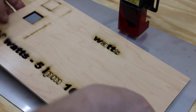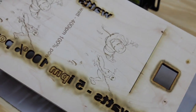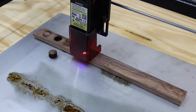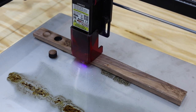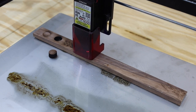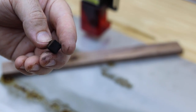The letters just fall right out. The kerf is so small that the pieces fit together like a puzzle. 1/4 inch plywood proved to be pretty easy, so I wanted to push this machine a little. I threw in a piece of 3/8 inch thick solid walnut. I found that at 10 inches per minute, I could cut through this in 5 or 6 passes. Even with thick material like this, the cuts came out super clean.